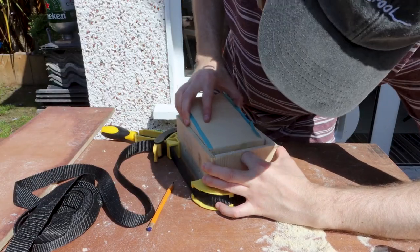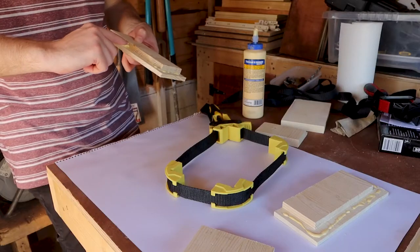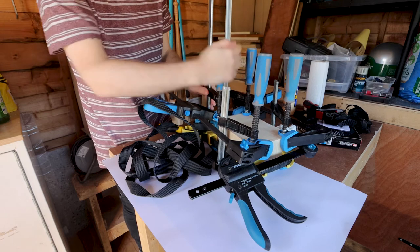Except it didn't fit perfectly. It went in but there were some pretty significant gaps, and when I flipped the base over it was tight on one end and quite loose on the other. A combination of things meant the box wasn't quite square, so the base didn't fit perfectly either. I didn't have enough wood left over to make a new base, so I had to go with what I had. I guess I took it as a given that because it was planed it was going to be square, and my cuts were bad too. I didn't know you had to continuously check for square as you worked. When I tried to clean up the side pieces with sanding I used a pretty rough grit sandpaper and removed way too much wood, leaving a pretty weird shape with big gaps that couldn't be closed no matter how hard I squeezed. I finished the day by gluing the base of the box together and sticking a heap of clamps on, hoping it would pull together into a perfectly square box — which is not really how it works.